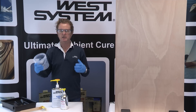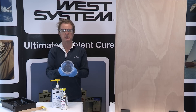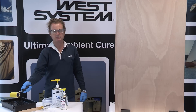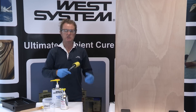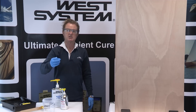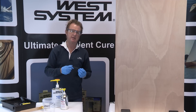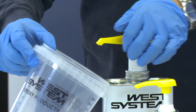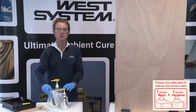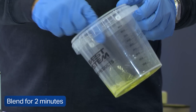For a really good finish you've got to use very clean equipment — a clean mixing pot, clean rollers free from any dust. Don't leave rollers in a dusty workshop or you'll be applying dust to your clear coating. Use a clean mixing stick too; don't use pieces of wood cut through a bandsaw as they'll contain shavings or contamination. I'm going to meter out three pumps of resin and three pumps of the 207 special coating hardener, then blend the two together for two minutes to a homogeneous mix.